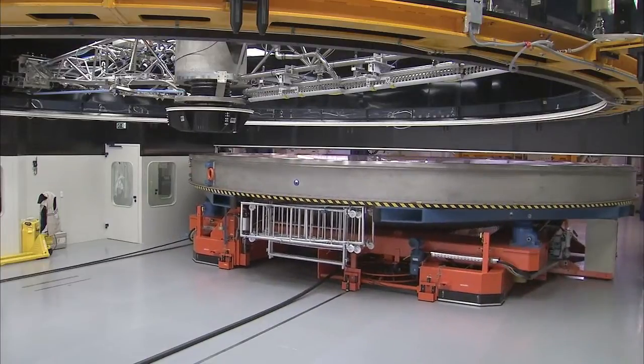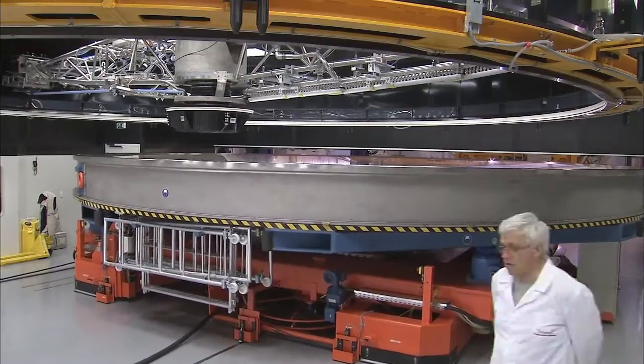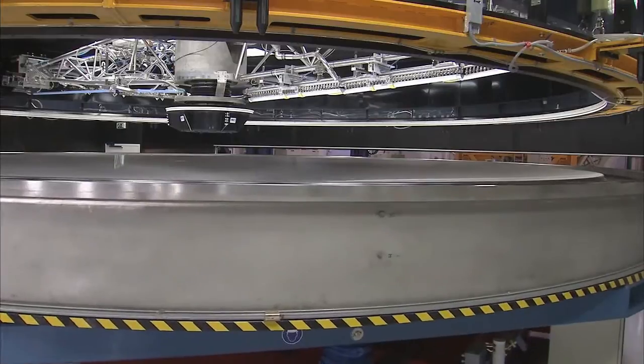The mirror is next taken into a clean room. The first action in the clean room is to treat any badly polluted areas on the mirror manually. This requires a steady and skillful hand in order to avoid scratching the surface. The point of doing this is to remove any particles that might not be easily flushed away during the subsequent washing. Afterwards, the vessel holding the mirror is positioned in the washing chamber where the old reflective coating of the mirror is washed off.